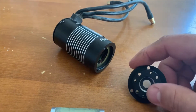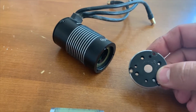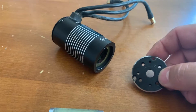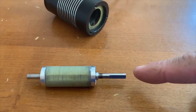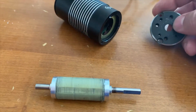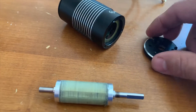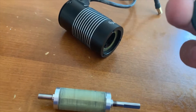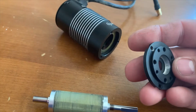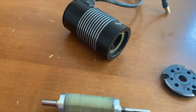You've got that output side cap, and you can see straight through the center opening where that bearing would rest. You can usually just use some kind of a punch that's a little bigger than the diameter of the rotor shaft to get on the end of that bearing and tap it out. That's the easy one to change — just be gentle with it. These are precision milled pieces where those bearings fit nice and snug.